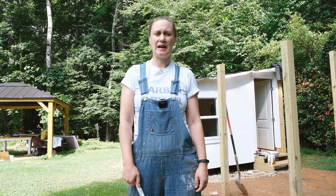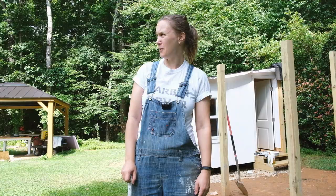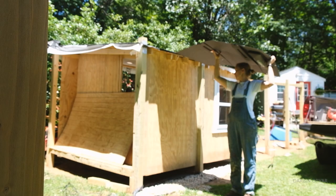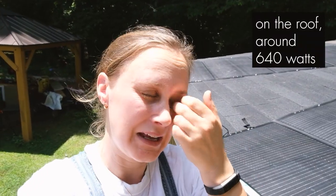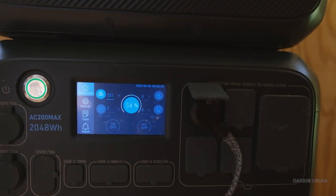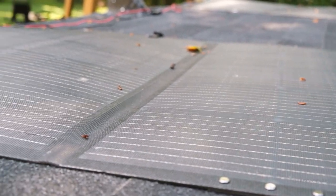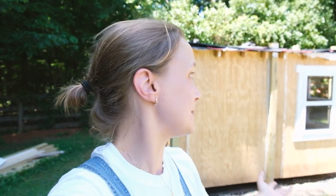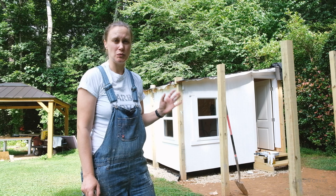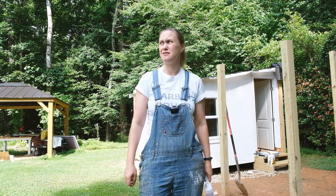New day — just about to do some painting but I was checking the levels we're getting right now. We put some portable solar panels up on the roof — there's actually a video review of those if you're interested. I just thought it would be a good test until we put up the rigid panels, to see what kind of sun exposure we're getting on the roof. The energy from those panels is funneling into the portable battery inside, so as of this point the little house is self-supporting in terms of energy. We got some shade on the solar panels — since they are in series they act as one, so if one panel gets shade and the other is in full sun, it shuts down both at the same time. We're only getting 98 watts currently. That's not ideal, and for planning the future project, that's why you want some in series and some in parallel. With part shade right now we're getting 293 watts — I was surprised by that. Oh, 326 now.